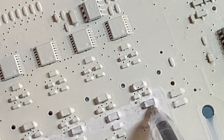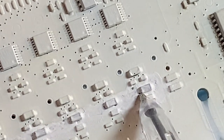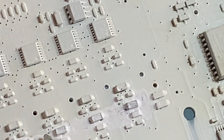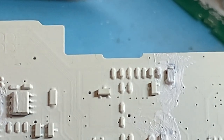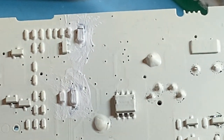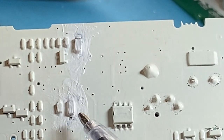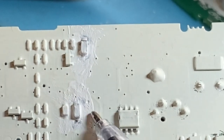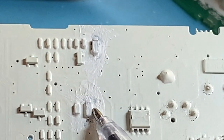Somewhere in the old history of things, the wrong capacitor values got installed by their pick and place machine. Don't know how it happened, but a whole heap of detectors came out with the wrong values here. And also, I'm going down here somewhere, if I remember rightly. Yeah, across. You can see this capacitor here has been touched up with white paint. They're also part of the wrong part install. So it's that one, the five up there,